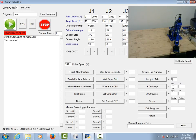We have some if statements. If an input is on it will jump to a tab, or if an input is off it can jump to a tab. So I can use inputs and outputs or switches to control program flow based on I/O.